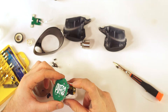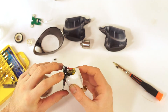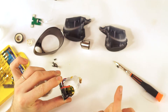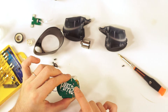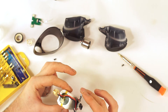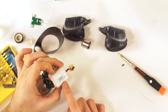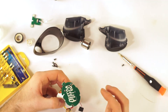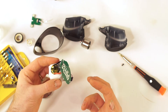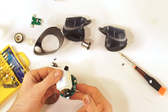There are a few ways to go about trying to fix this. I think it's the charge circuit or charge controller, so I don't know if that's on this board, this board, or this board here. I had some success soldering leads of a power supply directly to here, plugging it into the wall, and charging the battery that way. If that fails, or if I can't get this back up to a working voltage — it says right here 7.4 volts — I'm just gonna replace this battery pack with something that's got a little bit more oomph, like some 18650s in a little housing, and we'll upgrade this Puffco if we can't get it working. That's how to take apart your Puffco.